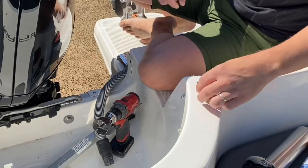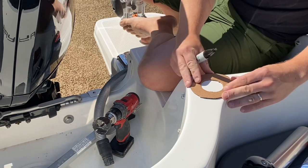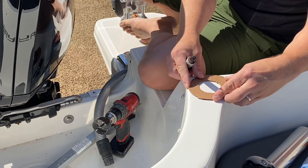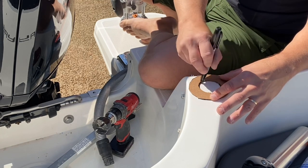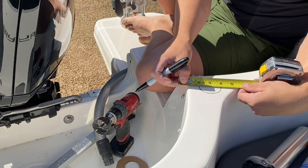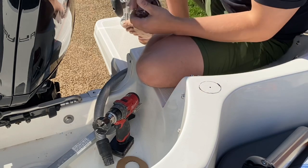Okay, so now we have our template — we can see how it's gonna fit. I'm going right in here. As I said, there's not a lot of overhang for this. We'll get best placement. I already did the other side. We've got a couple of layers of plywood under here, so it's nice and solid. Let's take a sharpie and just outline it. Then, taking my tape measure — I know that's a two-inch hole — I want to just mark center. Now I know where to start my drill.